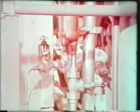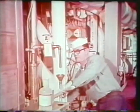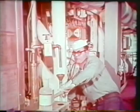To secure from sampling, first, close all valves on the sample line, starting with the valve closest to the water drum and working out to the sample exit valve. Finally, secure the coolant inlet valve. The cooling water outlet valve should be left open.